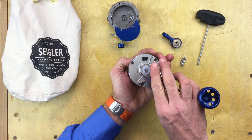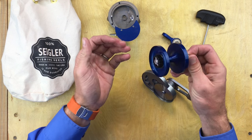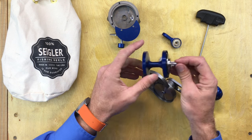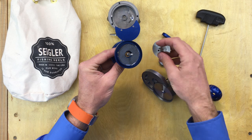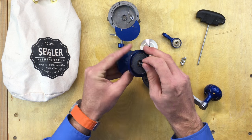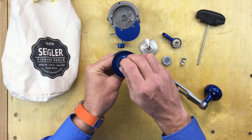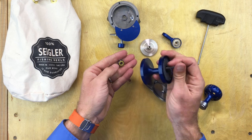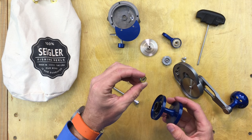You're going to turn it to the spool side, down, and lift straight up. Now you have your spool assembly, which you can hold by the spool shaft. To take this further apart, put your hand underneath the bottom side and pull directly up — there's your thrust plate, all one piece with your pinion gear. It's 316 stainless steel. Then you've got your stainless shaft, your carbon fiber drag washer. Let the spool shaft come through, turn it over, and push out the bearing with the spool. You've got one bearing on this side and a far side bearing — your ABEC 5 ceramic spool bearings, high-performance bearings from Boca Bearing in Florida.